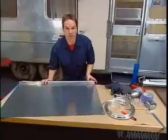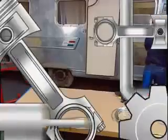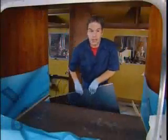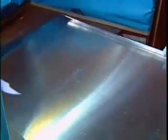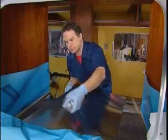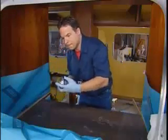I also add some silver plastic trim to the edge of the countertop lip — that puts a nice cap on this countertop. For information on this project or metal forming techniques, go to our website at DIYnetwork.com. We're going to install our countertop with a spray adhesive. First, we mask off the surrounding area to protect it from adhesive overspray. I'm going to do my countertop first on the bottom side — all we need is a light, even coat. We'll do the same to our countertop surface, just a tad along the cap. Let that tack up a couple minutes, then we'll drop in our countertop.